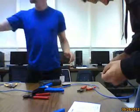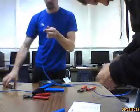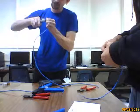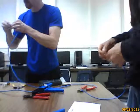That's okay. Have you crimped it? You could actually get away where you could just pull your connector out just a little bit. Grab something, trim off your Kevlar. It's not a big problem, it's just that it looks nicer if you don't have that just hanging there. And then make sure your casing's up past the tab.